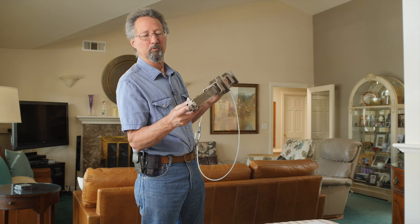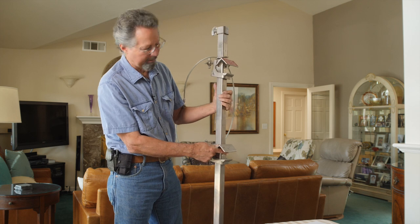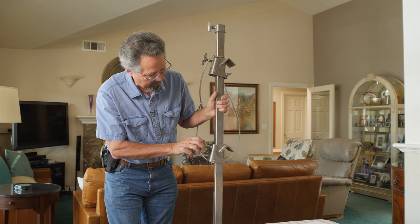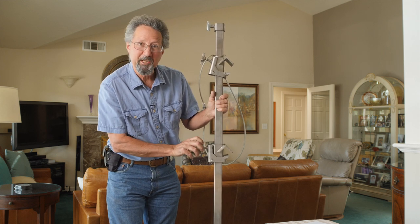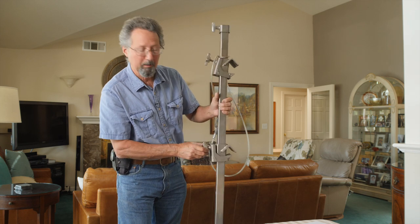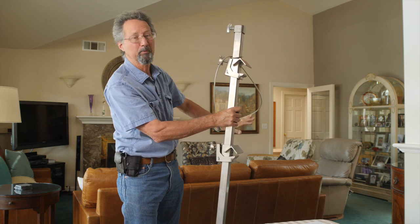This is the newer version of the candlestick condor mount. It has a pin like the old one that keys into the expanded metal floor of the condor, and then it has adjustable clamps that go onto the middle rail and the top handrail. What's different is they don't have to pass under the rail like the old ones did. This one has a jaw that when you tighten the knob, you can see the jaw hinges up and clamps onto the bottom of the rail, while at the same time a pin goes through a hole in the slider and puts pressure against the post itself — so one knob locks it off to both the post and the rail.